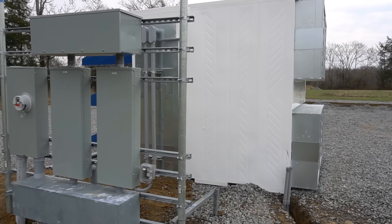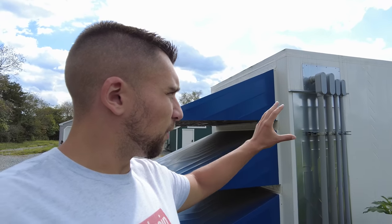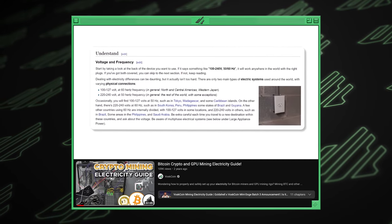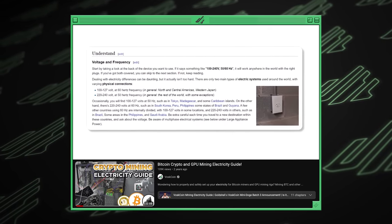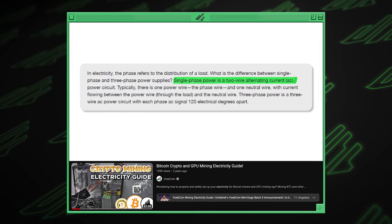One thing I noticed is I need to drill out the drain holes because they either have mud kicked up in them or paint from the factory blocking them. My power situation is pretty simple — I've got a 400 amp service feeding right into the building and I'm running 200 amps to each side. This is a 208-volt prototype version that Digital Shovel made, so you can rig it up with three-phase, running hot-hot-neutral, and basically operate it at two-thirds capacity.